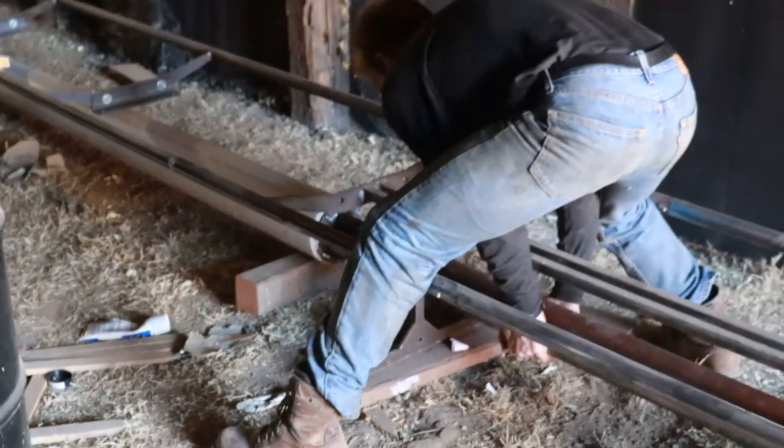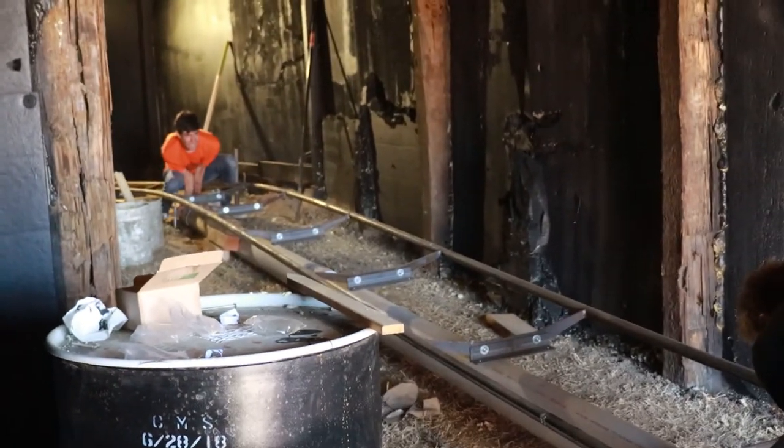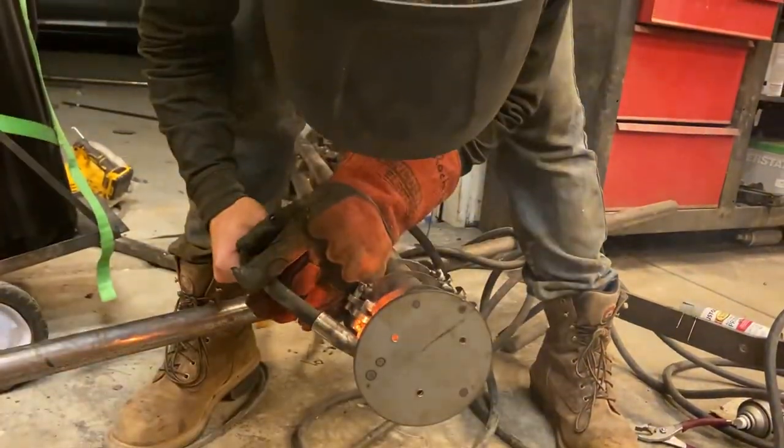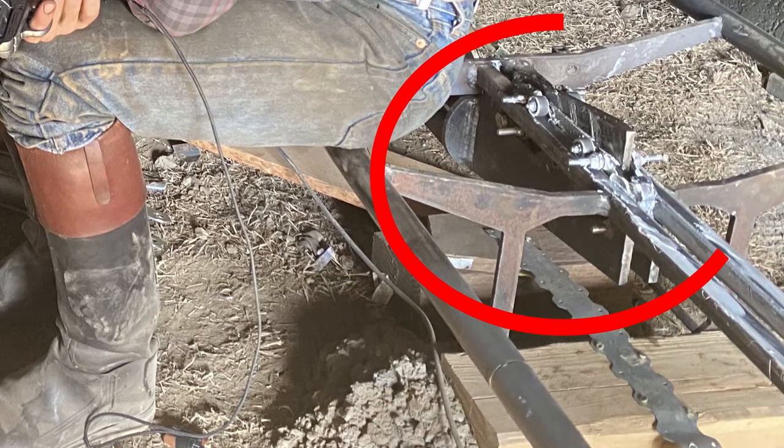Our air cannon is composed of two primary parts. One is a 6-inch PVC pipe, approximately 20 feet in length, and then our steel rod, which on one end has a gasket and ball bearings, which allow it to glide inside the pipe very smoothly. And then the cart side, which is essentially a wheel assembly attached to an internal track underneath the cart. This rod pushes the cart about 20 feet until it hits a buffer, which we created using sandwiched wood and rubber gaskets.